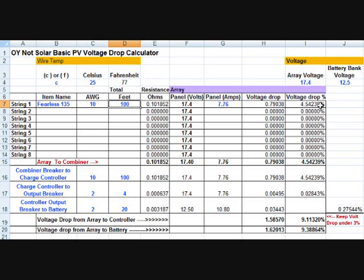The solar panel industry's requirement for a certified system is no more than 3% voltage drop. You can also change the temperature in here — at 25 degrees C (77°F) is the baseline, but if you go to 35 degrees you can see the voltage drop goes even higher. So if you live in a hot temperature zone you can really be affected by that. If I go down to 0°C, the voltage drop improves a little bit, but it's still above that 3% minimum.